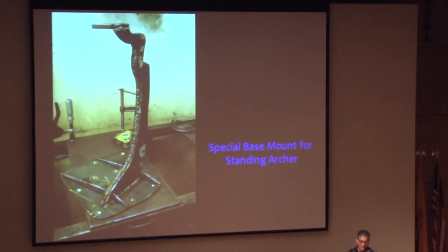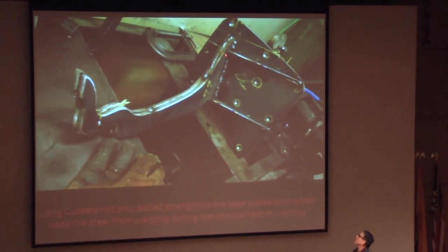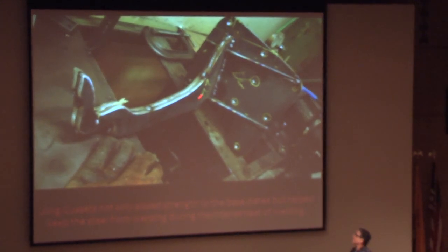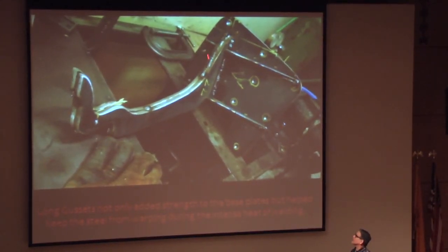This is the spine for the archer mount. The archer had a strange contrapostal pose and wasn't as symmetrical as the other warriors, so we had to do a different mount. These flanges here act as a support — there's only one bracket up top, so there's more ability for this to become a pendulum and move around, whereas the mounts with two leg supports were very stiff. To address potential vibration, this is two pieces of half-inch sandwiched together forming one-inch metal, with flanges to keep it from vibrating and to keep the plate straight during welding.